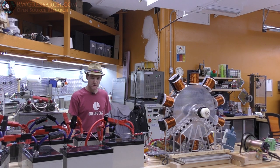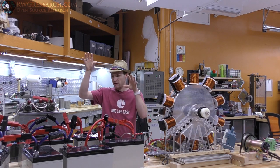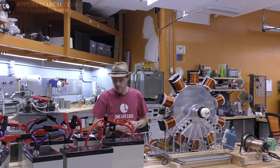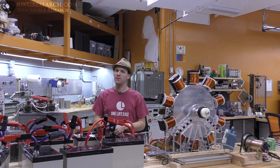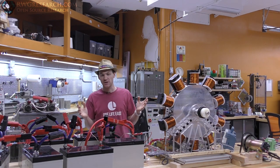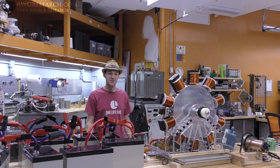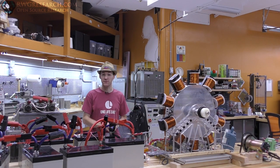Another thing I want to talk about: I put batteries in parallel and series — eight of these big 100 amp-hour batteries in parallel series, and the 35 amp-hour ones we've been using. I was using the big ones to charge the small ones because they were pretty low. What happened was those little batteries — four of them completely died. Very strange. The flyback energy or whatever happened damaged the batteries such that four of them were charging fine and are perfectly fine batteries, while the other four are basically open — they hold voltage but no current whatsoever. Kind of bizarre.